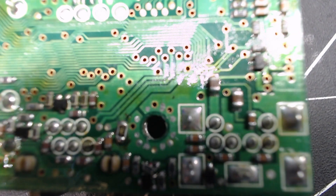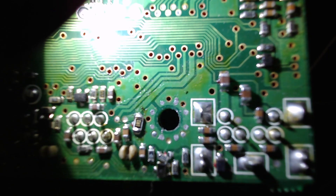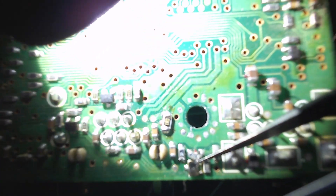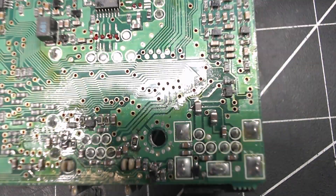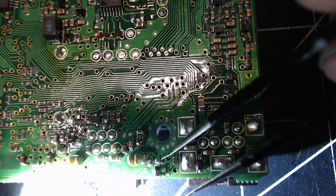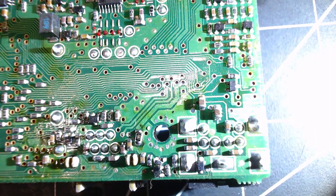That's interesting. After removing the board, if you look close here — just get the light on it — you'll see that there's one crooked-looking resistor, but there's also one that's very crooked right there. It's almost to the point where it's not making any contact at all. That could possibly be causing us issues because it's right next to that Q96 IC for the push-to-talk circuit. There's another one up there that's a little bit connected, but someone's definitely been in here before. Maybe it was knocked when they put the board back in, or when they were working on that other resistor up there. So let's take a look at that.